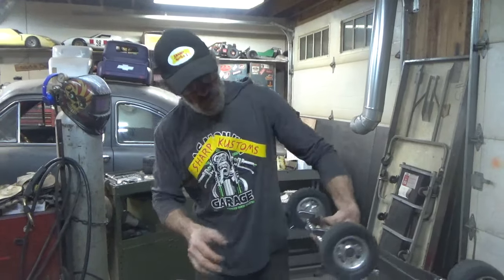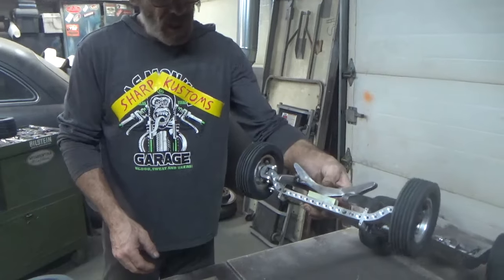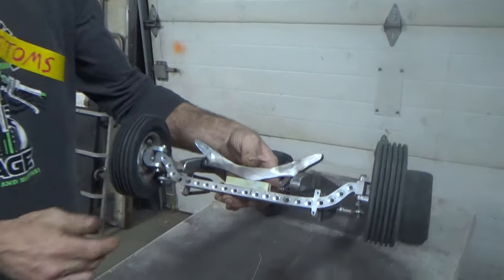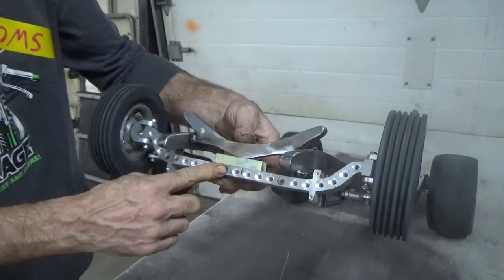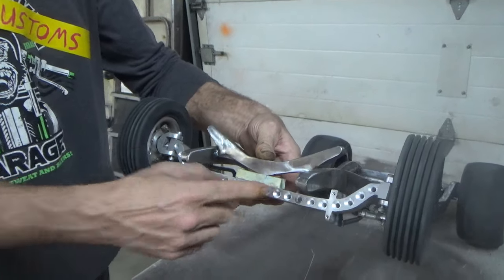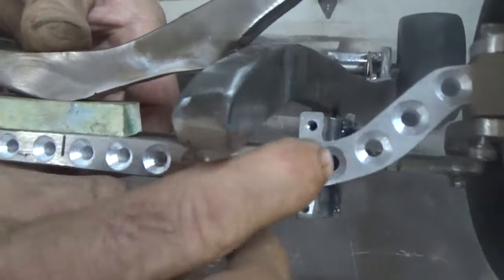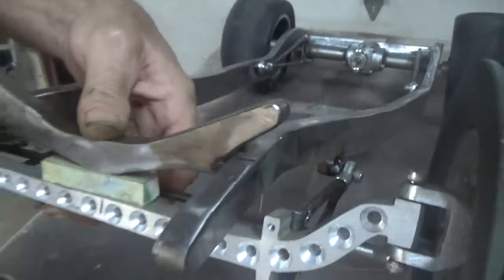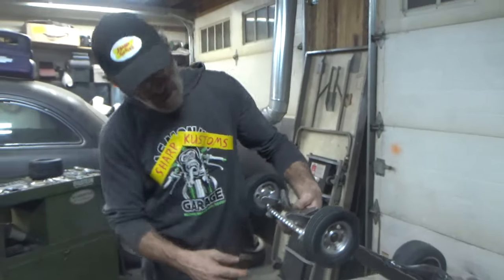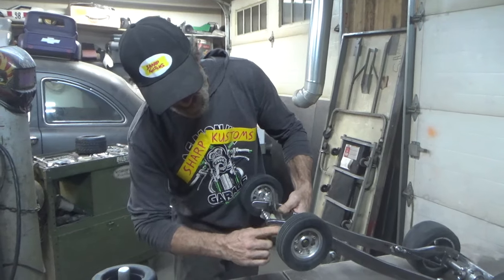I was like, I think I'm going to go a little bit wider. I will keep the profile this way because, as you can see, it's 21 holes. 21 holes that I drilled in this straight axle with a small bit, and then I went to a 250 quarter inch, and then I chamfered every hole, both sides. That is 84 times I hit those holes, and then, of course, machined, drilled out two holes.